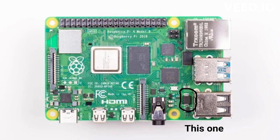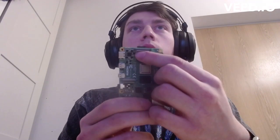Other methods I found on the internet didn't work, so I desoldered the diode — I actually had it somewhere but lost it. I couldn't find a replacement for it, but I thought the problem might be with the PMIC, the power management unit — but it wasn't. After pouring ethanol over the board, I confirmed that the diode was fried, and I wanted to share the knowledge.